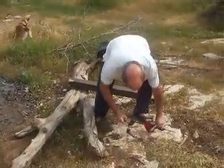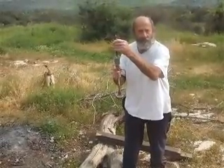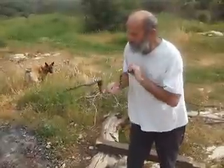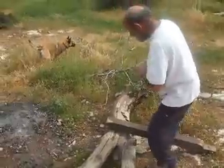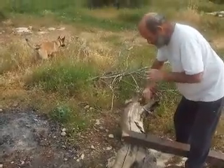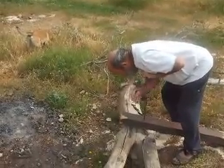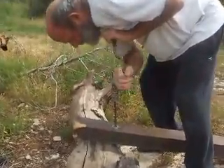And this one, this is called a brace and bit. This is the brace, this part here. This is the bit — the tooth or the cutting part. The bit has got a screw at the end. It helps you push it into the work — it pulls while you push. I can drill a little bit with this. I can either hold it here. This pommel is on ball bearings so that it can turn freely while I turn the drill. Or I can also put my weight on the bit, and you see me going in even better.